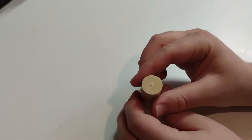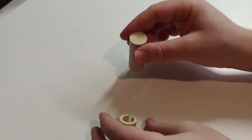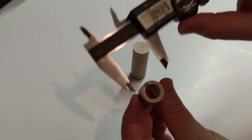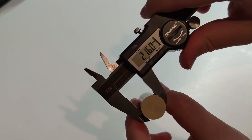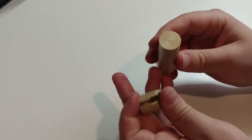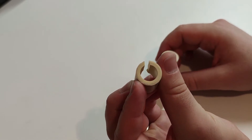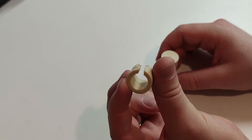But cutting like that presented some problems. The plastic is probably extruded and has some internal stresses, which caused the outside diameter to shrink when I machined a slot into the tube. It was not much — about 0.5 of a millimeter — but enough to cause some problems when gluing since I had a quite close fit between the plastic and the bearing block. If I were to do it again, I would probably cut the plastic first, see the final diameter, then drill the appropriate hole into the bearing block.